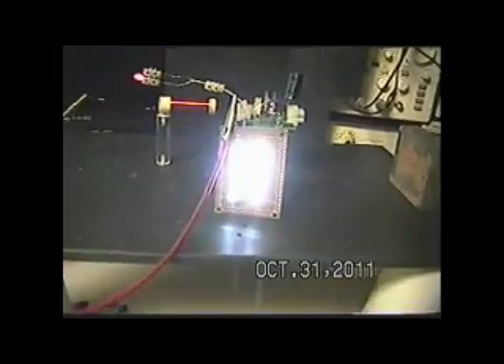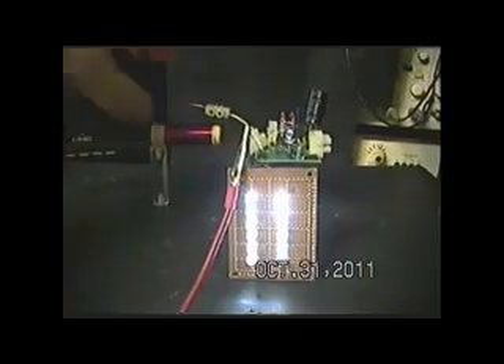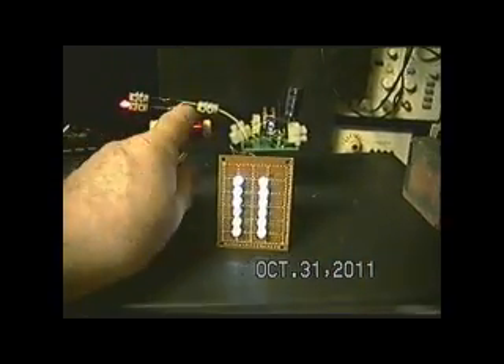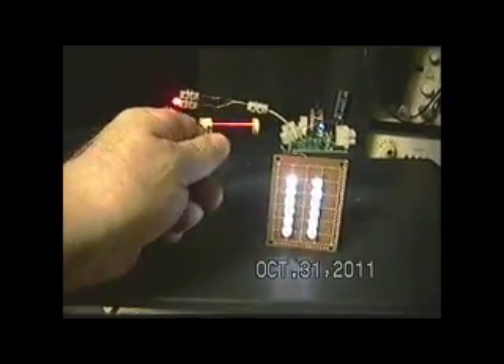The strange thing about this is that it literally takes hours to get this thing tuned correctly, because it varies with the time of day. The intensity varies, and once you get it out of sync you may or may not get it back into sync — it may take forever to get it running again. To get it running, you have to get enough signal in through this AV plug set into the power rails to charge that 1000 mic to where it will start the oscillator up. Once the oscillator starts up, we're operating in a feedback loop. If I kill the thing — okay, I've basically killed it. Now you can see how things change, and I hang it back up here and we're back.